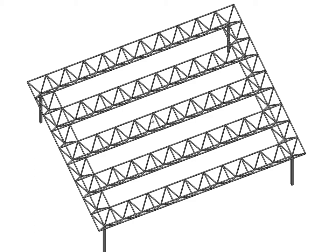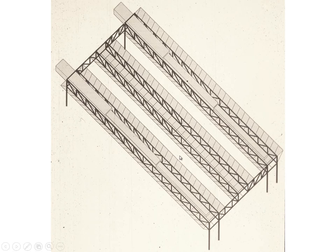What's even more elegant is avoiding having two trusses that need to be braced together, since that bracing costs money and interferes with other design intentions. For example, ductwork coming down between two trusses requires figuring out how to get those trusses to brace each other — the only solution being some sort of rigid frame structure. This scheme works pretty well, with feeder ducts coming down and the option of using adjacent bays for other purposes.